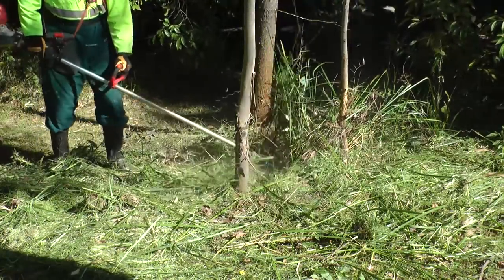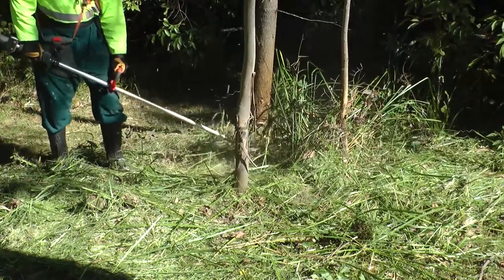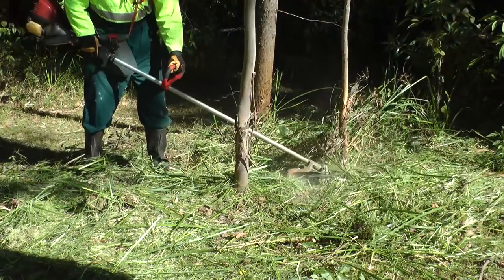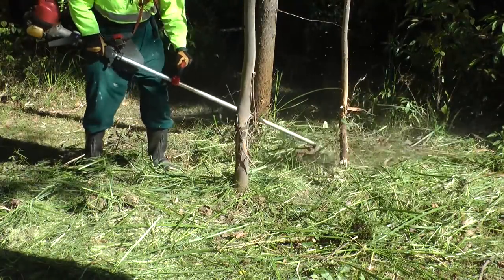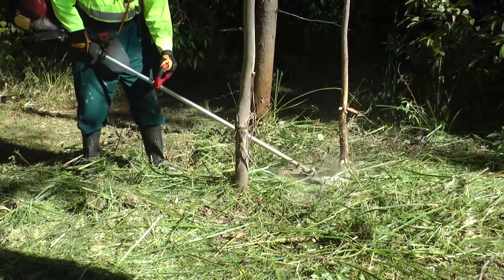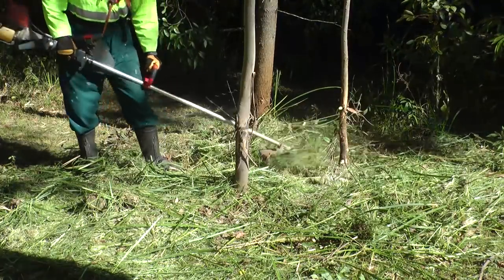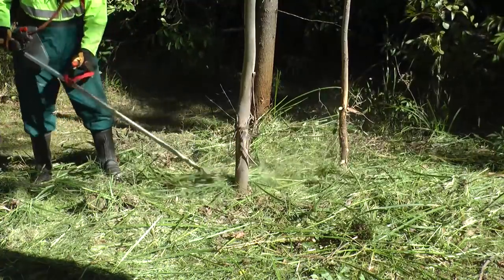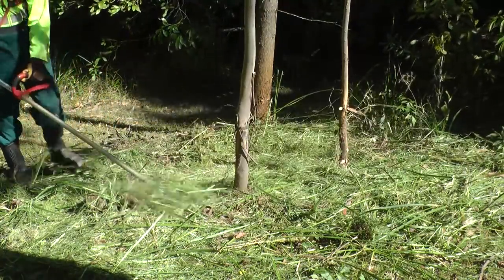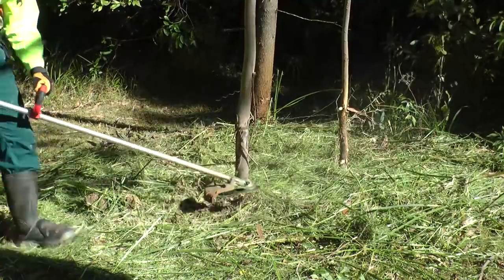This grass could be cut a lot more easily with a knife or a chisel blade, but it is very abrasive to sharp teeth. This is because dust from dirt roads settles on the leaves, and when you get a light rain, this dust washes down around the base of the grass where it accumulates and dries. Clear this stuff for an hour and you will find that the tips of a sharp cutting edge will be polished round. Even a tungsten carbide blade would be a throwaway after an hour of clearing this stuff.